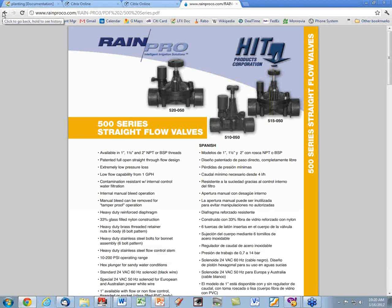And so therefore, that's why you get the positive opening and closing in the low flow situation, which is a challenge for valves such as our 200 series valve with a standard hard one-piece diaphragm. Gotcha. And I have to say, for the Land FX users, for drip irrigation we usually do valve kits, and this isn't in a kit, but you could add this valve as a regular valve and then edit its description to add on the filter and pressure regulator desired with the valve.